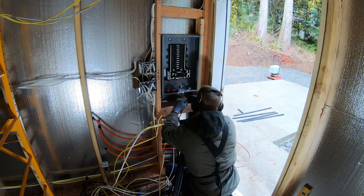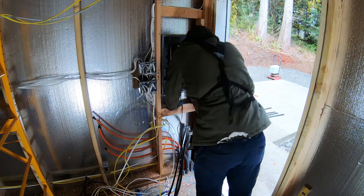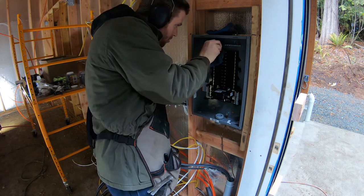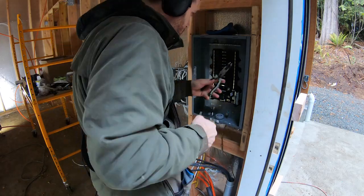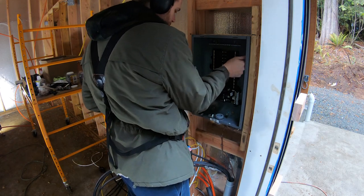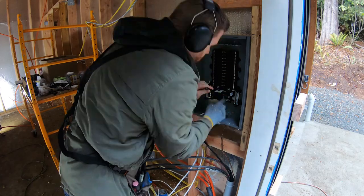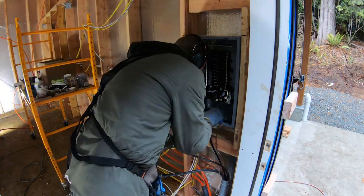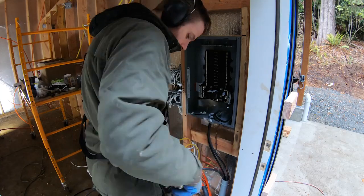Now that I know which wire is which, I can go ahead and hook them up into the panel and I'll hook them up into the house later. On the panel itself, because this is a subpanel, I have to keep the grounds and the neutrals separate. You can see that I've added a separate ground bar from the main bar that comes with the panel. That makes this box unbonded, and that's why I have four conductors going back to the house — the ground needs to go all the way back to the main where it is bonded. To figure out the size of the wires, I just use an online calculator. You input your distance and how many amps you need to carry and it tells you the wire size you need.